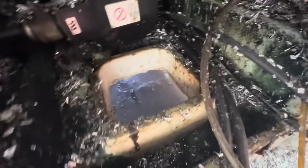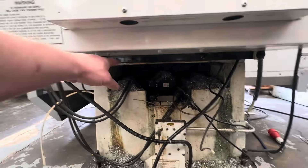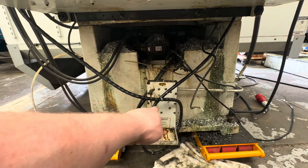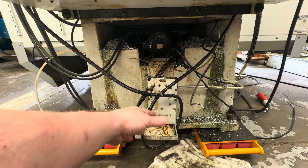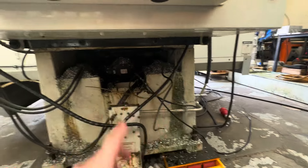You've got a drain off the back here which is built up with a lot of swarf, and you want to keep this area clear because any coolant that runs down the back will come into here. This has got the oil/coolant separator where the oil goes into a pot, the oil floats and skims off the top, and then the coolant can run back into the coolant tank.